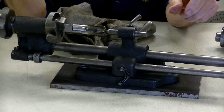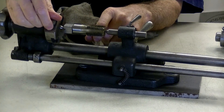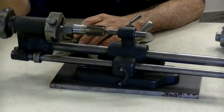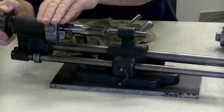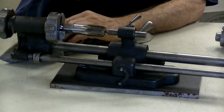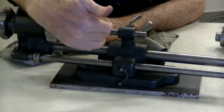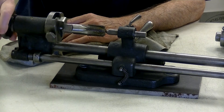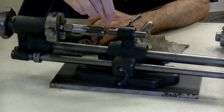Now to set the head to the cam. Loosen the locking screw that says set. Bring the cam up towards the top and align the start and finish with the flute vertical to the table — same as all radial relief attachments, the setting is usually the same. So now we have the tap set to the head and the head set to the cam. You then offer this up to the tool and cutter grinder with the grinding wheel coming in on the chamfer at the front of the tap. As you turn the attachment, the whole body of the grinder tilts back from the grinding wheel to give you relief behind the cutting edge.